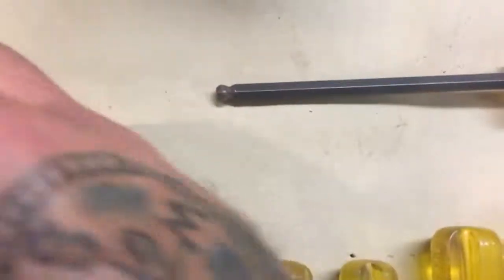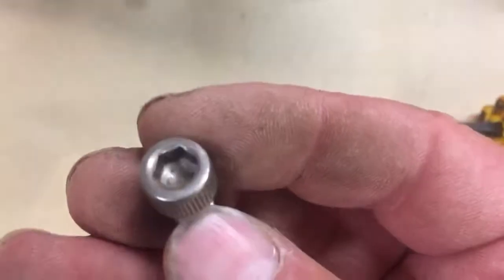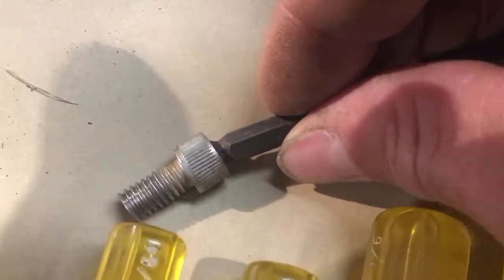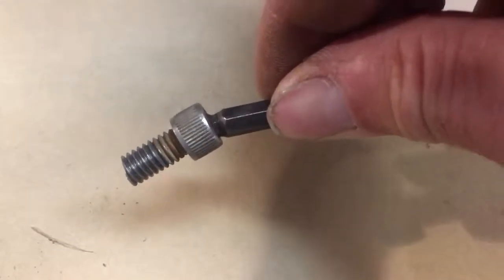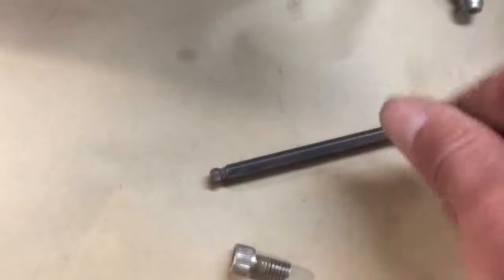They're really nice because when you're using an Allen wrench on a hex bolt, these tools that have the round ball head on them let you get in there — you can put them in straight or turn them at an angle to turn the bolt. That makes it really nice because if you have a spot that's hard to get to, you can come in at an angle and get your bolt started.